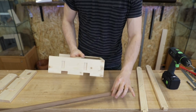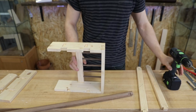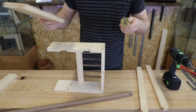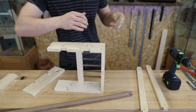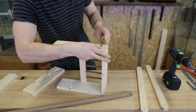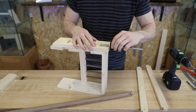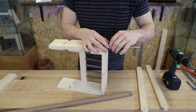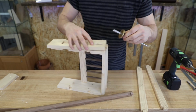So this is going to be the full width of the dowel. So we're going back to 25 millimeters. So referencing in from the front, that was where the center of this is going to be. So we're going to do exactly the same one here, referencing in from the front, do our line up, and then we need to get the center point of both of those two holes that we've drilled on the top there. So that is the larger one, and we want the bottom.